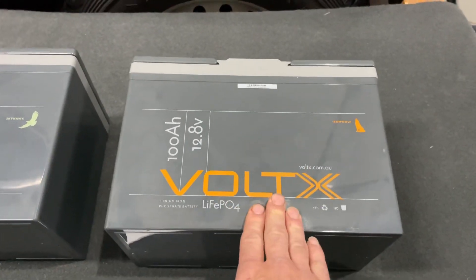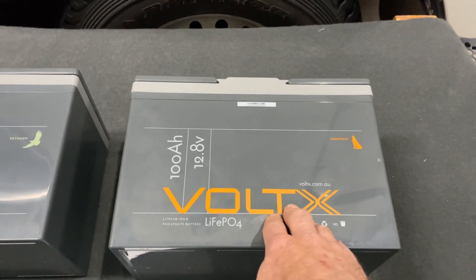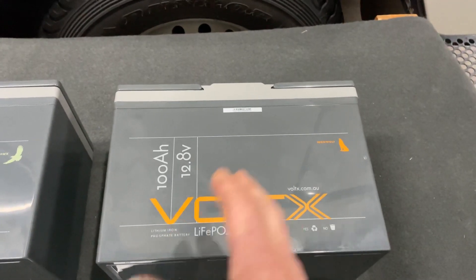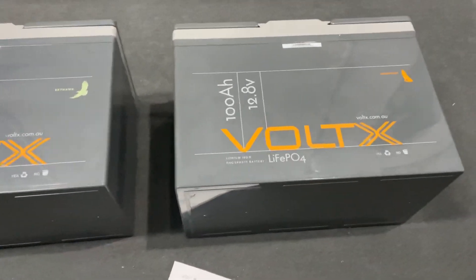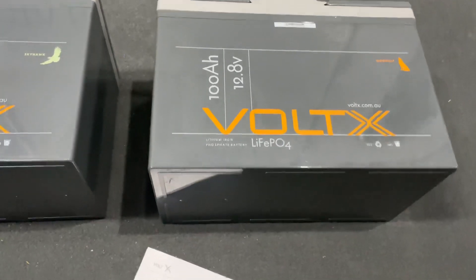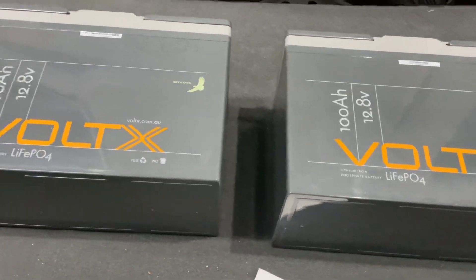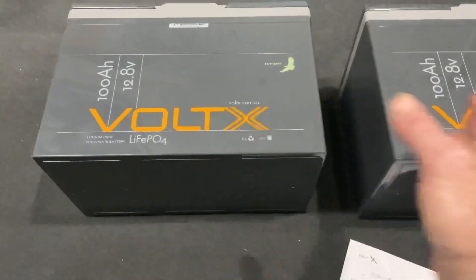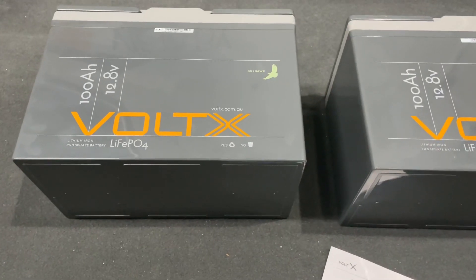The plus is a big advantage here — you can put six in parallel and six in series, giving you 600 amp hours at around 76.8 volts if you're calling it a 12.8 volt battery. They both use prismatic cells according to the specs.